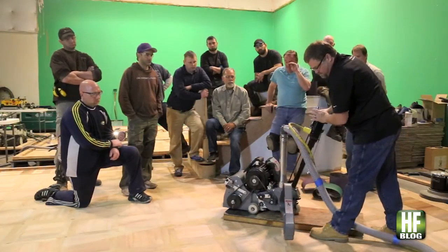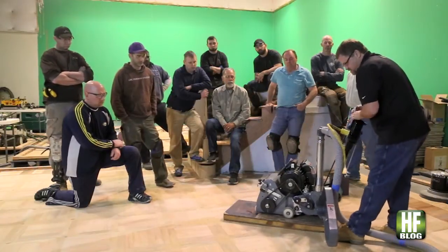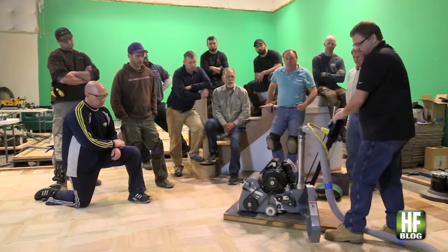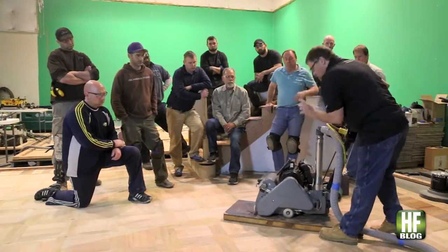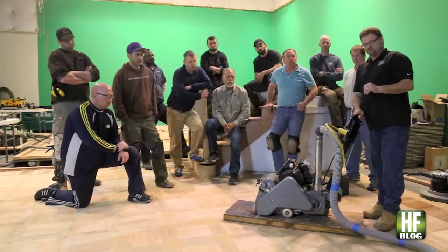Because if I bring the wheels up on the drum sander, I just change the pitch. So I'll stay nice and flat. So I'm going to hit it here. I'm going to travel forward. I'm going to pick it up and do it again. What I'm looking for is a consistent sand pattern completely across the face of that drum. That's all I'm after.